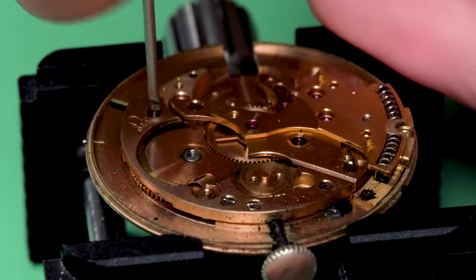Makes you appreciate these little watches. Now we can put everything into the cleaning basket for the watch cleaning machine. All the parts need to go into either one of the tiny baskets or some section of the bigger basket, and then that whole basket will get submerged into the cleaning fluids and go through each of the cycles. Even the mainspring is going in, and this mainspring seems to be in fine shape — planning on reusing it.